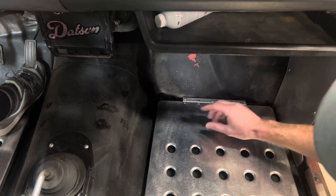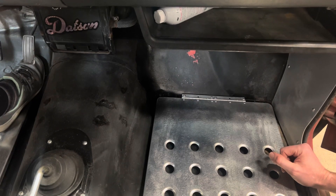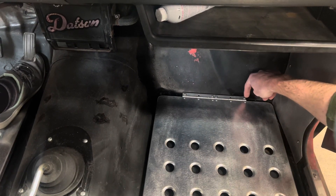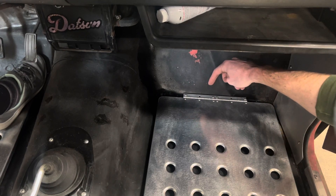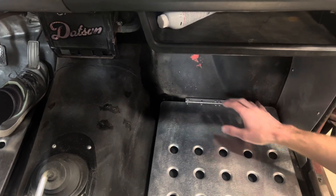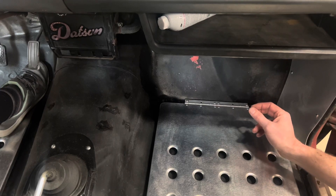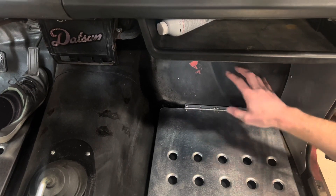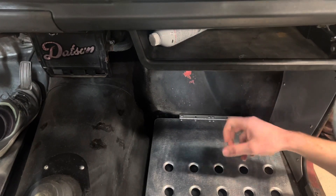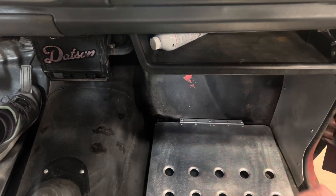Another option is that we'll provide a number 12 stainless steel sheet metal screw. If you choose, you don't have to use the rivnuts — you could just run sheet metal screws down through it. You'll have little points sticking out the bottom, but that comes with it as another option. If you don't want to hassle with aligning all the rivnuts for the front part, you can just flip it over on the spacers, drill a couple of holes, run in the machine screws, and call it a day.